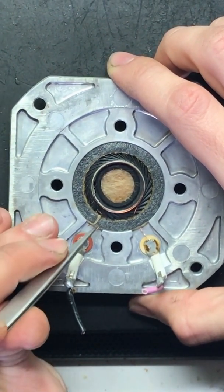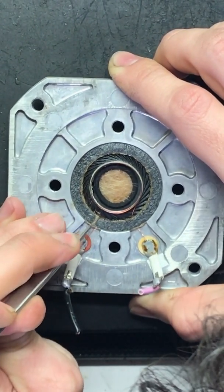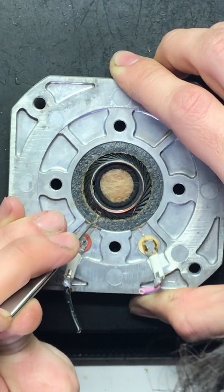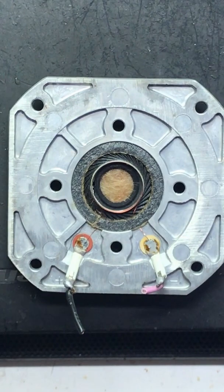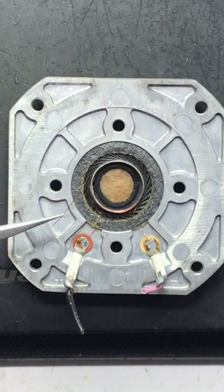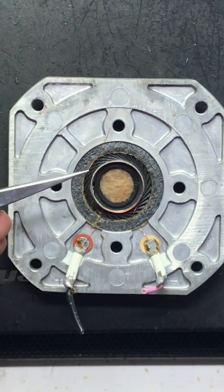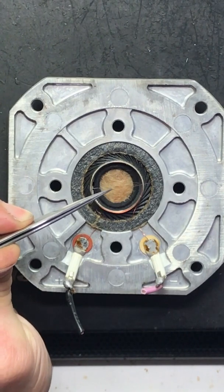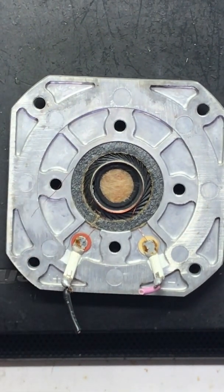In those cases, what I will do is make a slot here very gently using my tweezers. Sorry for my English — when you are concentrating on these things and speaking in a language that is not your mother tongue at the same time, it's not easy to do a good repair. I already have some coil sourced from a completely unrepairable tweeter. It's important to keep this wire because it's a very particular coil — the conductor is not round but squarish, which is why these speakers are extremely efficient.